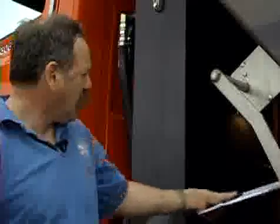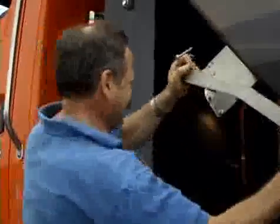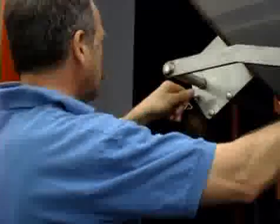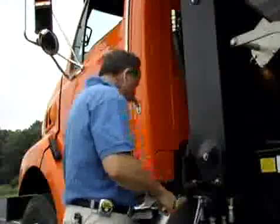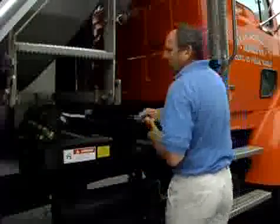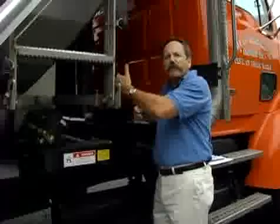We're going to set the gate right now. Because this truck is going to be used primarily for salt, we'll set the gate opening for approximately two inches. For those that would use sand-salt combinations, the gate opening might be a little bit more. What we're going to do right now is pull the pin and set this for approximately two inches. Once it is set, I'll walk across to the other side and we'll actually measure it. It's important that you measure it specifically for each truck and each type of material.